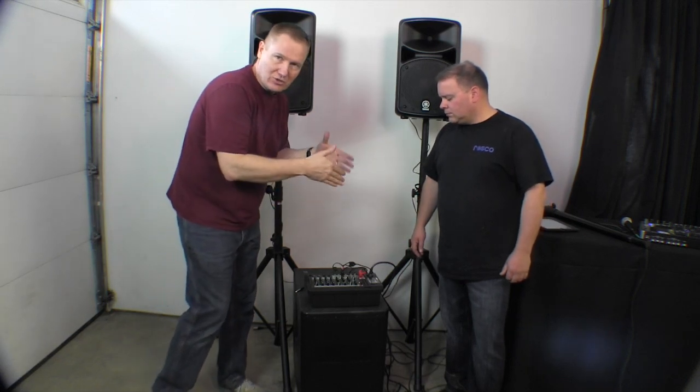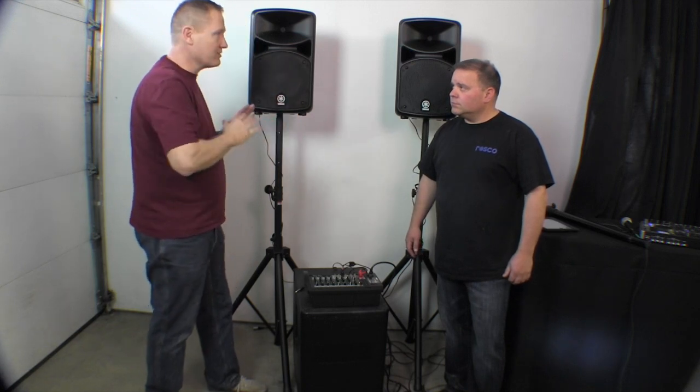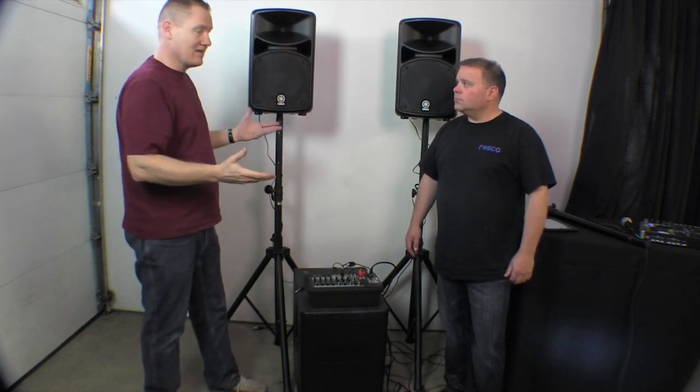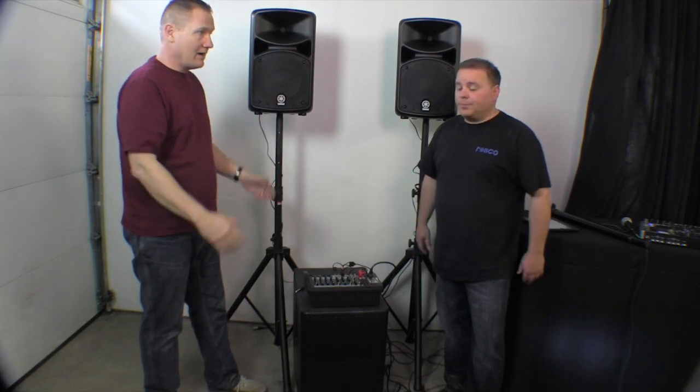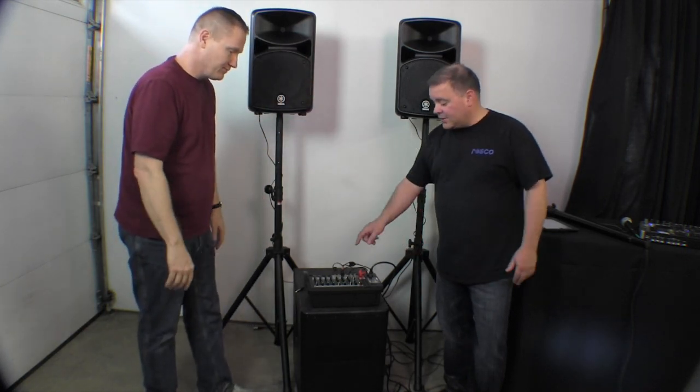We all grew up in stereo and thought it was so cool, but what you're getting to is that the bass can be over-strong in the left channel instead of the right. A lot of audio guys are summing the bass to the subs and running stereo on the highs. On this particular board it has the ability to switch, so the two channels sum together and you're sending out a mono signal. In our little example here, you could hear a huge difference — the volume just seemed to be louder.